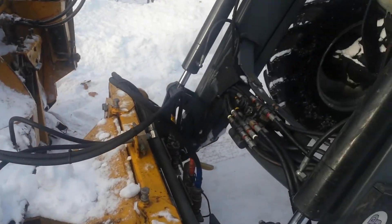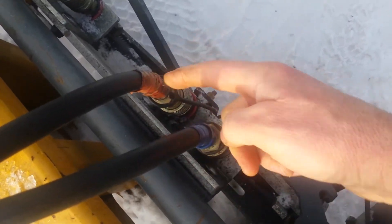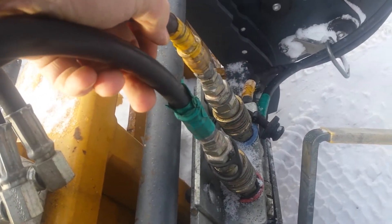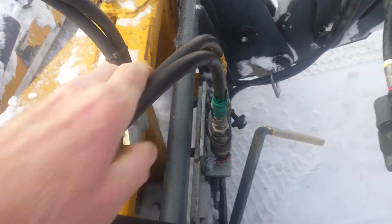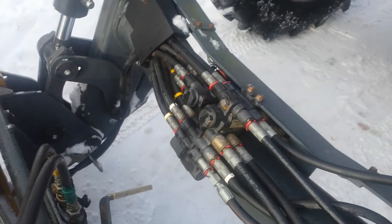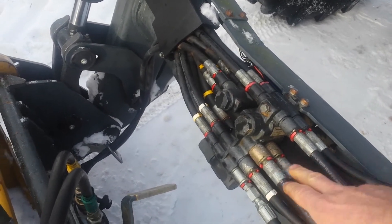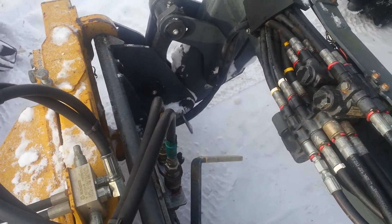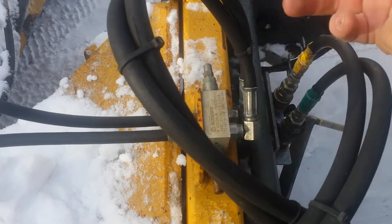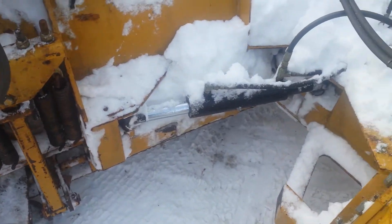The hardest part is undoing the hoses. This is how the remotes work on this plow. There are two sets of hoses here, and I've got them color-coded with electrical tape. I've got the John Deere colors over here, because there are a whole bunch of different ways you can hook it up and I like it hooked up one way only. Two hoses come off these cylinders — the bucket cylinders — and there's a button inside. There are two buttons and they control each of these. I think that is a pressure release valve, so if you bump something, it allows the oil to flow wherever it needs to go. It's a complicated setup, but it works great.